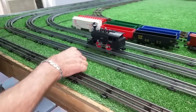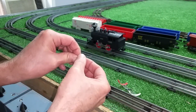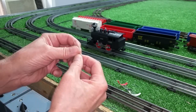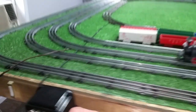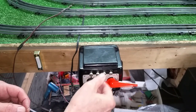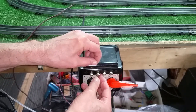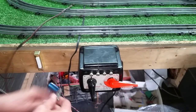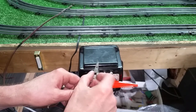You saw that it will not run at all. So we take our diode — diodes are called semiconductors, and the reason they call them that is they only conduct electricity in one direction. There's a line around one end of the diode; it will conduct electricity in this direction. So we can go to a standard AC transformer and just using one diode, add this to the transformer. I've got a magnetic lock-on on that same rail with clip leads on it, so we clip this on here.